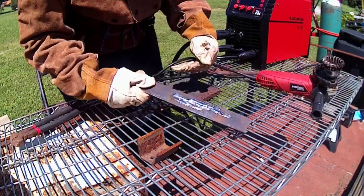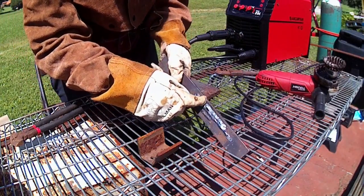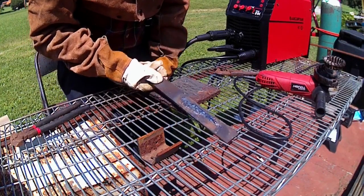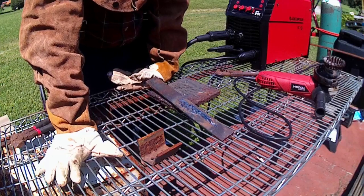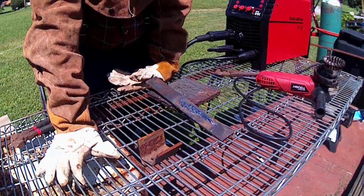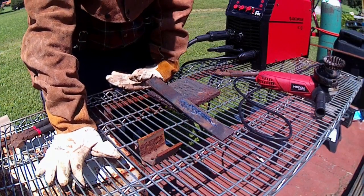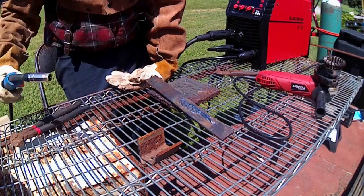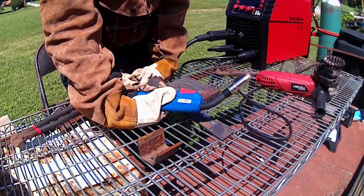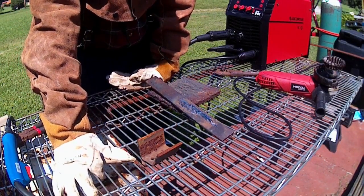Showing terrible welds, but you can definitely see where it pulses like that. It leaves that little ripple effect in there. It does give a nice flat weld with decent penetration though. So once you get the grip of it, I'd say it'll do MIG fairly solidly once you give it the chance. Like I said, those cold starts, and the nozzle here really likes to eat up that spatter. It gets clogged up kind of quick. So between that, it's not bad.